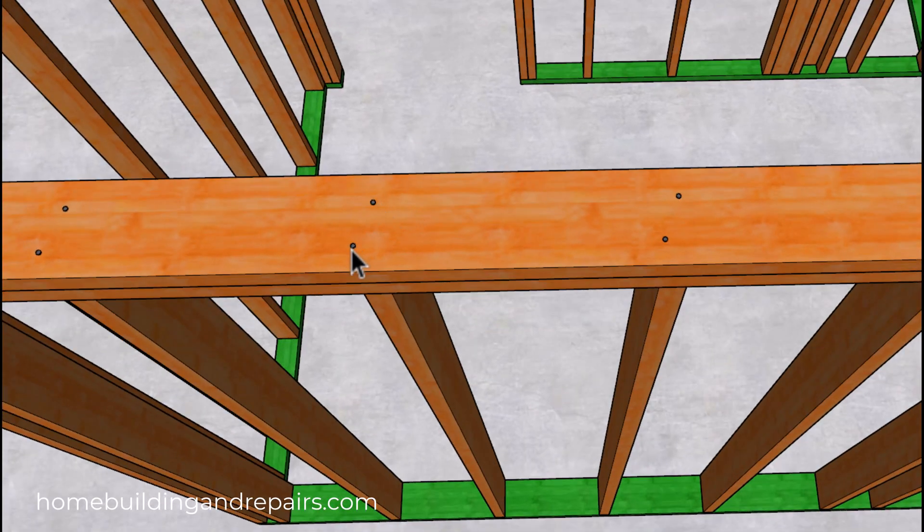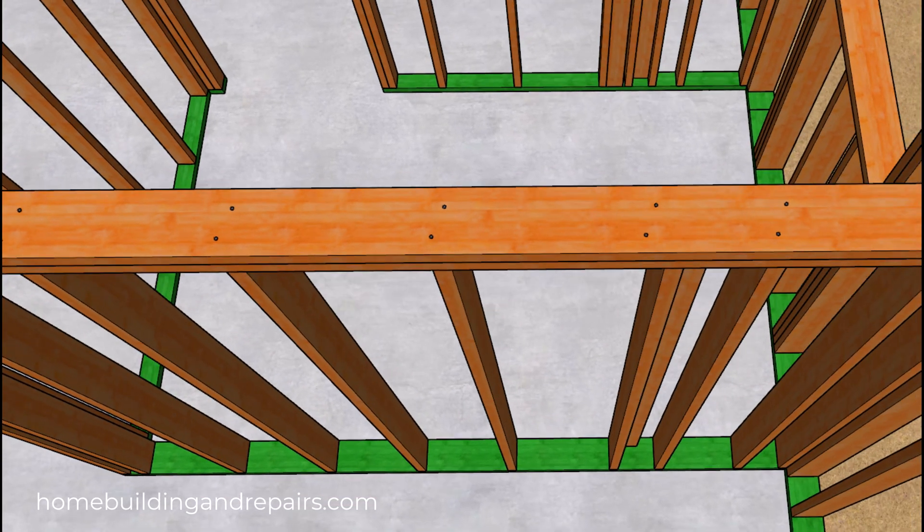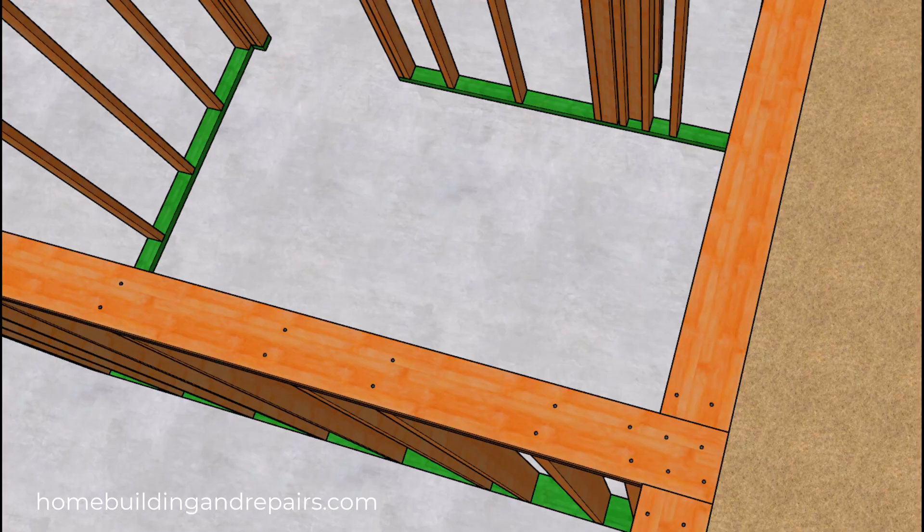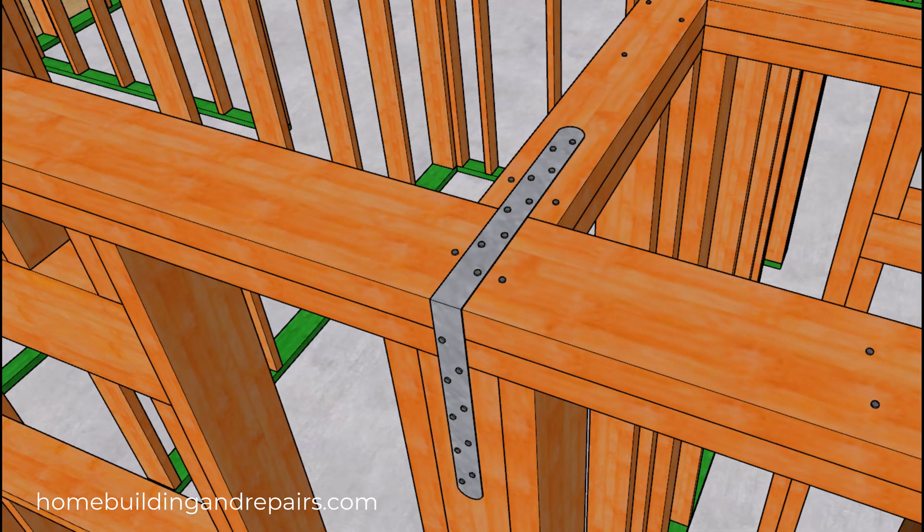Again, two nails for our two by six wall, and they are over or near the framing studs. They don't have to be exactly over the framing stud — I don't do that because I don't want to hit the nails going from the lower top framing plate into the wall framing stud. I like to just move them over a little bit. If you know you're going to have plumbing in a certain area, adjust the nailing patterns for that as well.